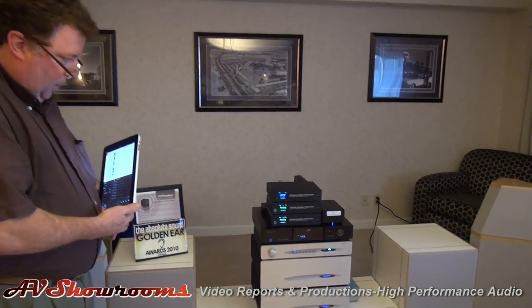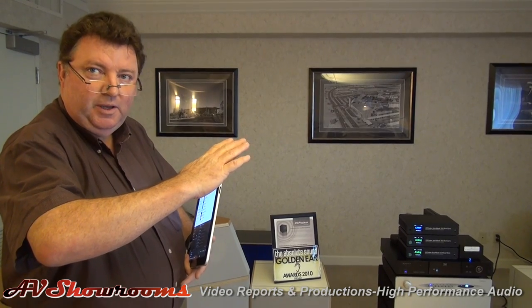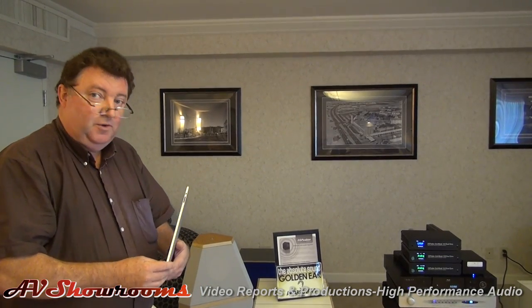I like the remote control tone — that's nifty. Well, there's no standard in recording. Some recordings are too dark, most of them are too bright. We've implemented a very cool thing called Quick Tone, which with one jog of the remote control gives you a lift of the bass 1 dB and cuts the highs 1 dB, so you can immediately warm up the recording and soften it. But it leaves the mid-range — the critical mid-range — unaltered between 200 Hz and 2kHz. Customers like it; a lot of people buy the thing just for that feature.